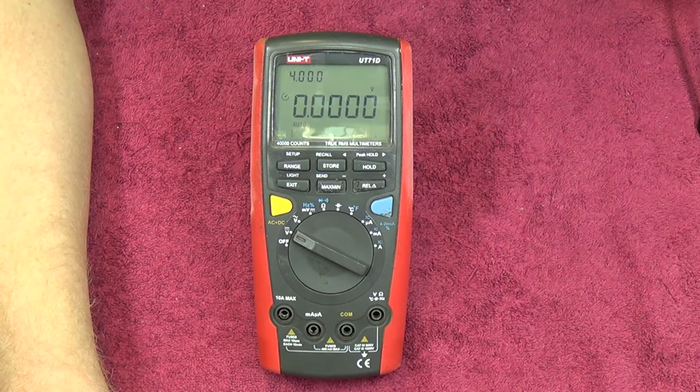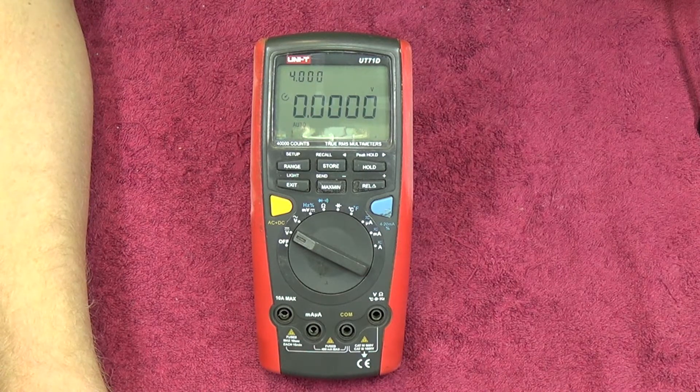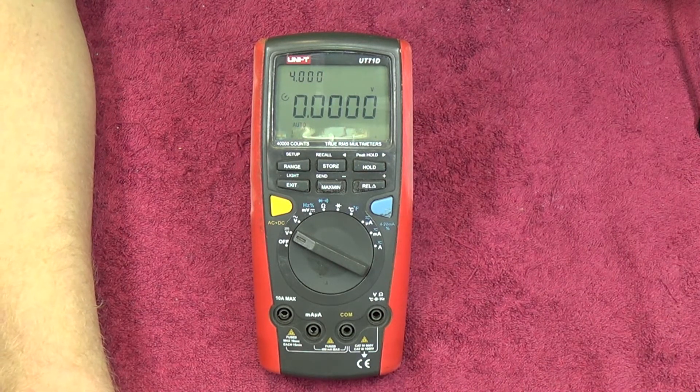It has full icon display, setup, and input impedance for DC volts: 2.5 gigaohms on the DC 400 millivolt range and 10 megaohms on all other ranges. So on the 400 millivolt DC range they've got a 2.5 gigaohm input impedance, which is different - I haven't seen that around much. Then there's a 4-20 milliamp loop with 1% plus 50 count, fused 10 amp current measurement, and voltage and current AC plus DC measurements - so it looks like you can do simultaneous. That's pretty much the basis of this unit.